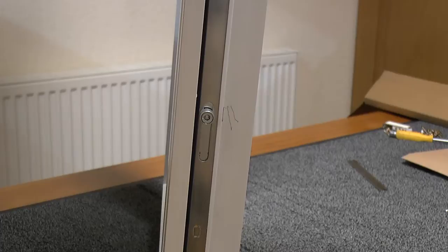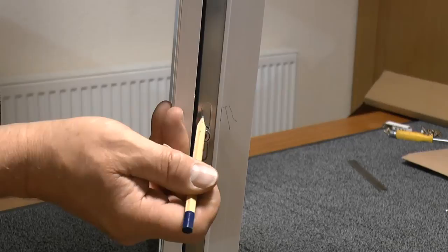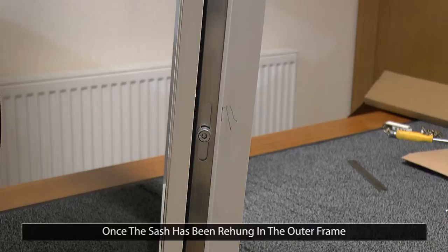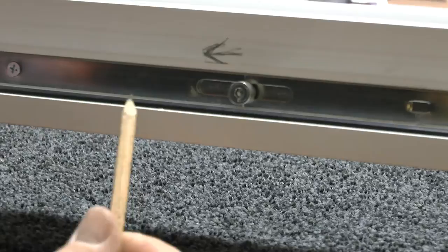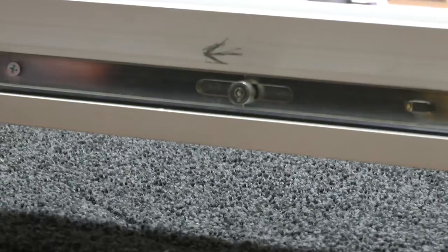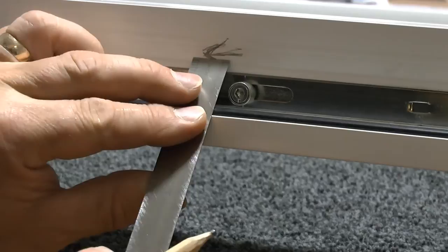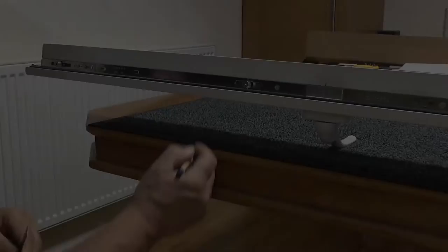So we've decided and determined the travel direction, and now we want to take the position of the roller onto the outer sash. We need to be to the back edge of the arrow, one and a half millimetres up, and transfer that line onto the sash. So to replicate that twice more down this side of the opening sash, we'll put the arrow in again just as a reminder, and that side is done. On this particular sash we don't have any rollers on the top, but on wider windows you could very well find that there is one on the top.